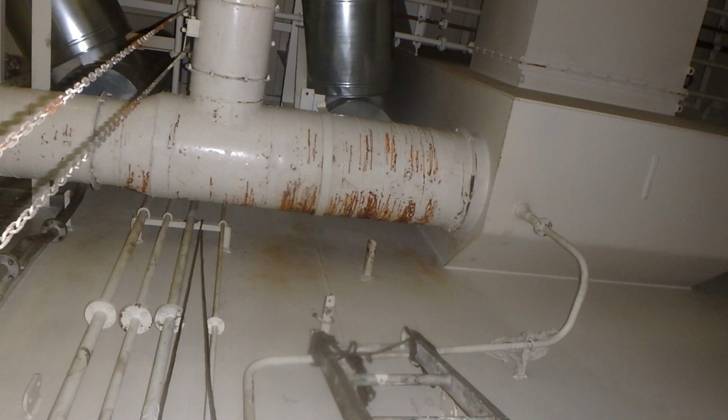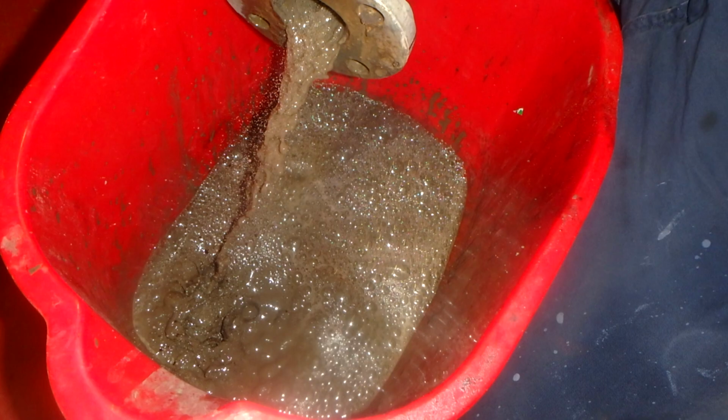Also, I would like to tell you that before you overhaul all these parts of the turbocharger, a very good practice is to verify that your drains are draining, because there is a tank that collects any rain falling down the exhaust funnel, and there is piping that also can get stuck. And what happens if this piping is stuck? We always check that, and always keep in mind all the rain will be accumulated inside the engine.